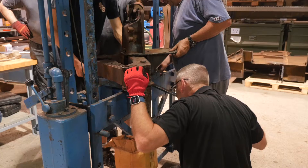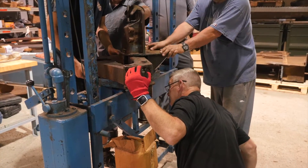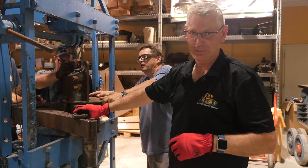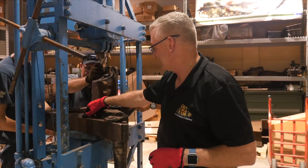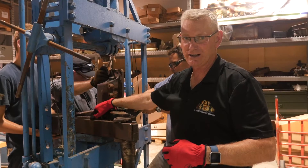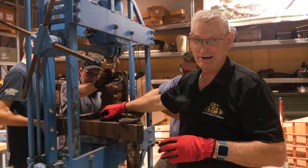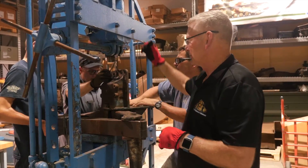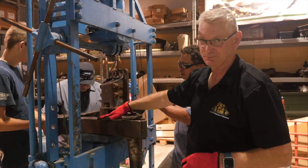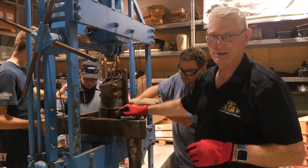What we're doing right now is setting up the suspension so that we can push the pin out — it's been a little bit of a pain. We got the bolt and pin here. We got the castellated nut off the other side, which actually should have stayed on. Pulled this nut off and then punched it through — unfortunately we can't get the nut back on. So we're working around it to try to make sure it's even, and then we can start using the 20-ton press to push out that tapered pin. We're going to do the far side with the leaf springs first because then it will be a little easier to manhandle.